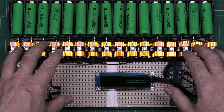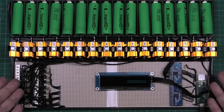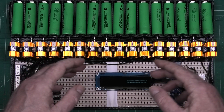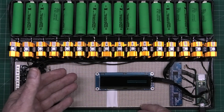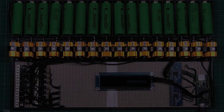What's happening is there's back-feed - I don't know how or where yet. If I plug a battery cell in, it powers everything up. So what I need to do is possibly put a FET on the negative side, so when I plug the batteries in there's zero power, then plug the Arduino in and it fires the FET up and connects all the cells. I don't know why this is happening - it still doesn't work yet.